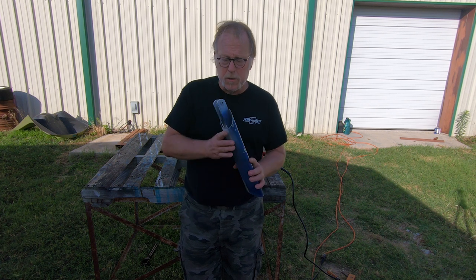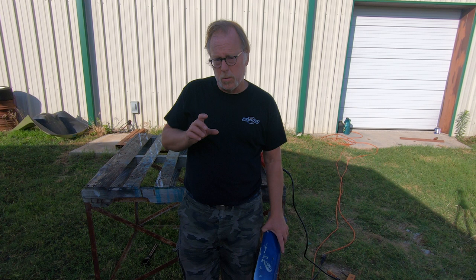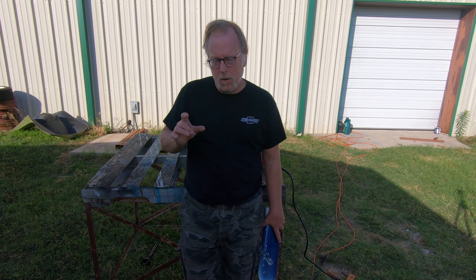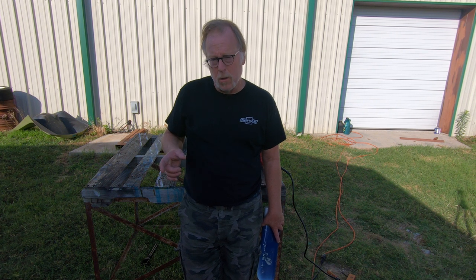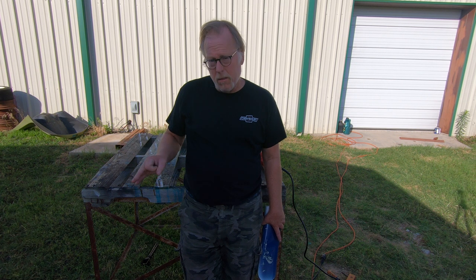What we're going to do on the good lift struts is take the one we just got from Air Salvage and get that stripped, and the other lift strut, which is good, we're going to get that stripped, Alodined, and then prime it and paint it. The other thing we have to do is put those steps on there, and on the Army aircraft there are stencils showing where to put that step. So we have that information. I'll show you how to properly put a vinyl stencil on. We've got those all made. They're inside the shop, and then those will be done.